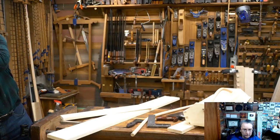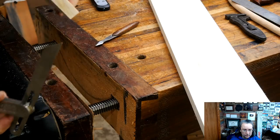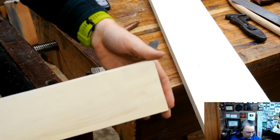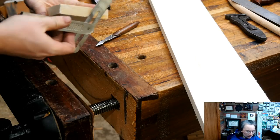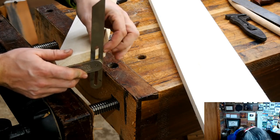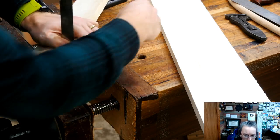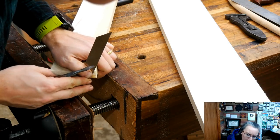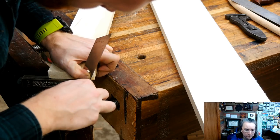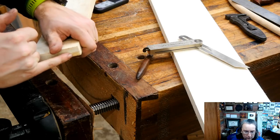To cut off the bottom corner, we need to know what angle we're cutting at. We have this bevel gauge set to that angle and we can mark it. Right now I'm going to put this on here — one point right on the corner and the other point back a little bit — lock that down and mark it. That is the angle this particular one is flaring at. The important thing here is the distance: this side of the line is right on that corner and the other side is down a little ways — we need to find out what that measurement is.